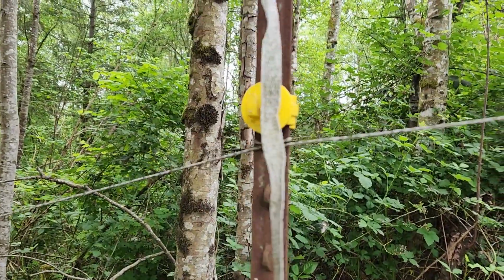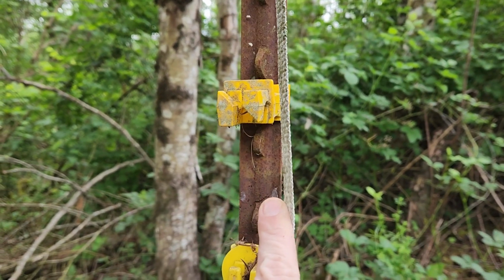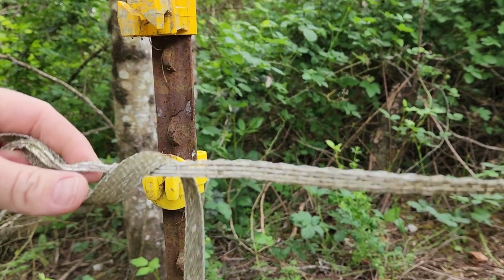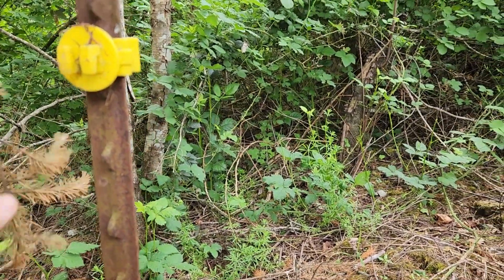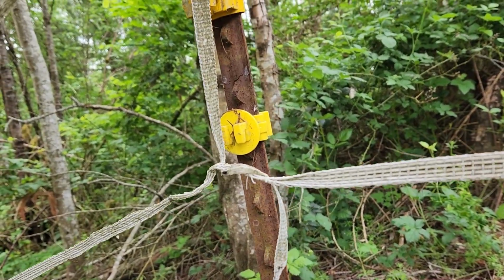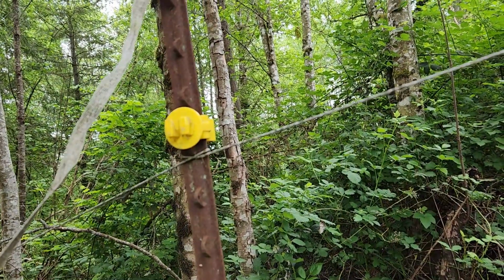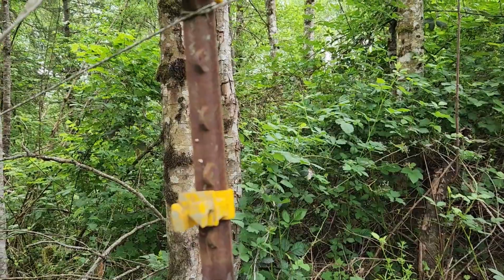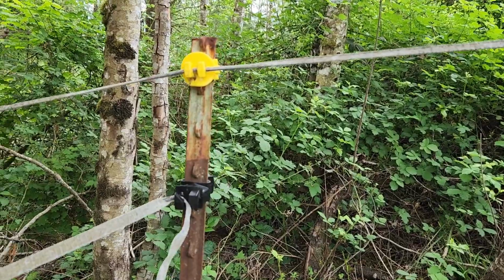So what I'm seeing here is that he just kind of interchanged and wrapped this smaller paddock fence in with the big paddock fence, and he just kind of got these lines together so they would all be electrified. But I'm pretty sure that's what's causing a big short. And so I think I'm going to have to cut some wire here, kind of redo it some, and then put an electrical current jump from one fence to the other. I think that is what I'm going to have to do to get it to properly connect without shorting out. So I'm going to go get my tools.